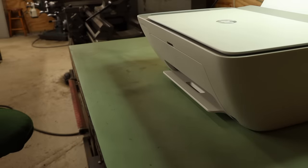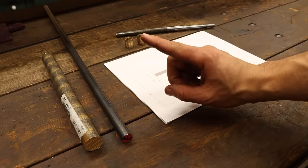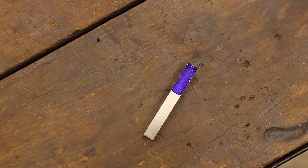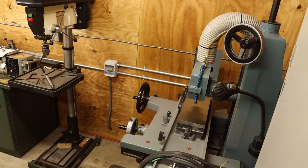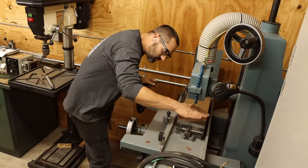Okay, so I've got myself some drawings here, and I've got my material, so we're ready to start making parts, right? Not so fast. To cut the threads, I'm going to need an Acme thread cutting tool. Specifically one for a 10 TPI thread. I could just wing this on the bench grinder like I usually do, but I kind of want this to be precise. If only there was some other grinding machine in the shop that could do such a thing. Okay, I'm going to make this cutter on the surface grinder.